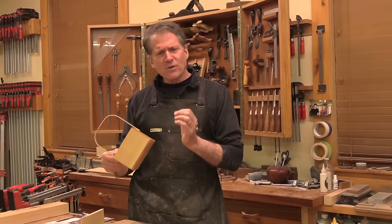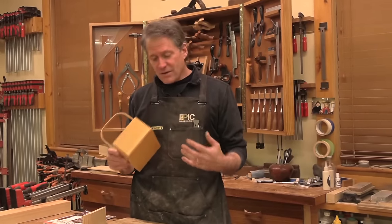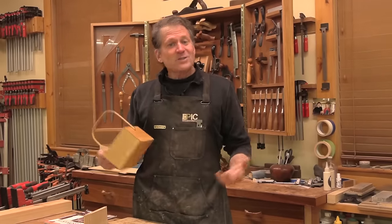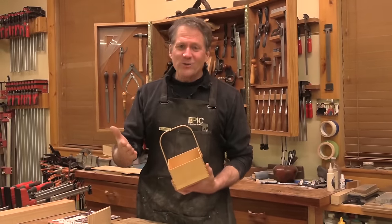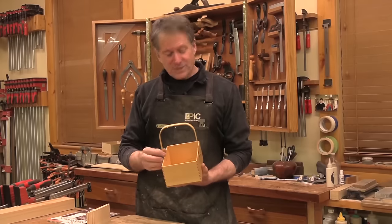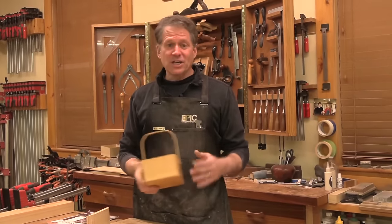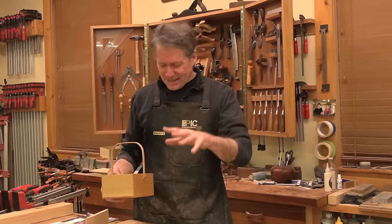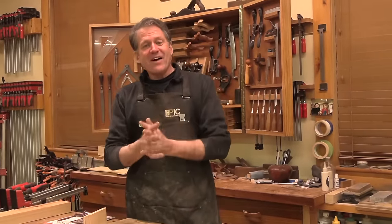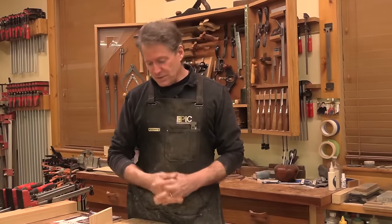And it features some really interesting uses of materials, in one of our new favorites, white pine. I'm sorry if you're in the part of the country where you can't use it or find it as much, but you can substitute other pines, I think. You're just going to have to check the seasonal movement. We'll get to that later. We're going to make, to start off, a finger joint jig for the table saw, for the crosscut sled.